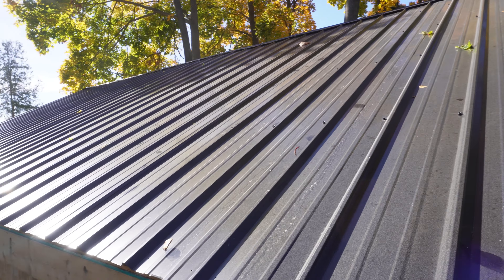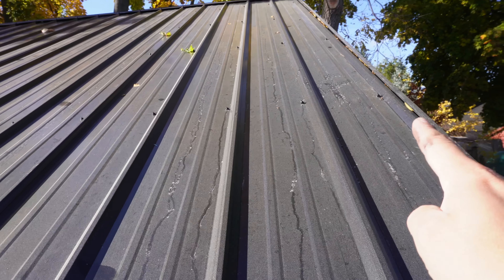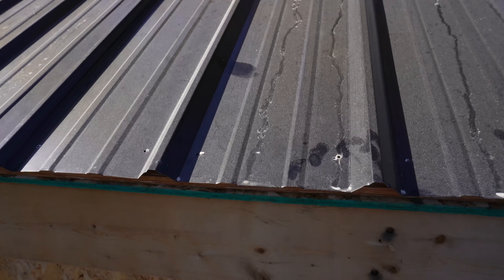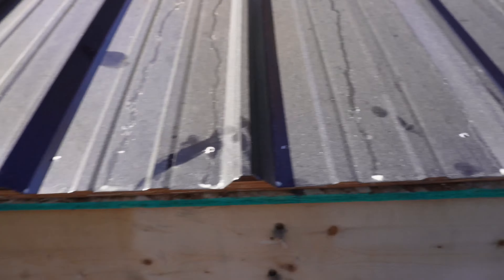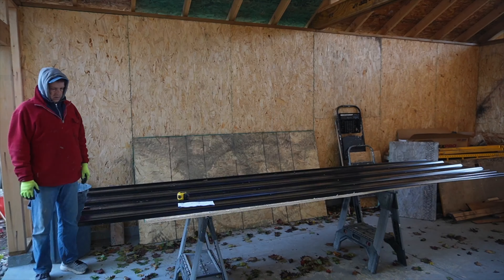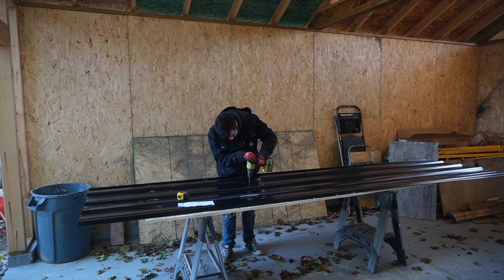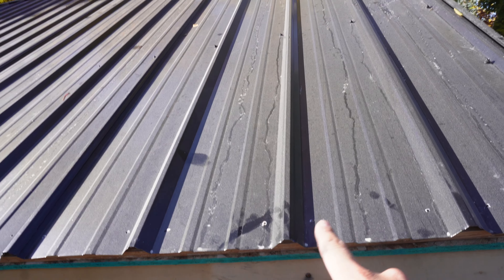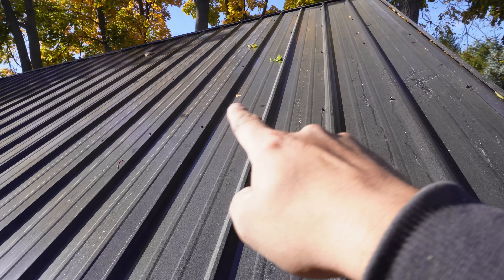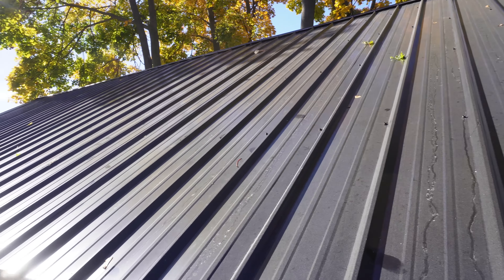One tip I've got to give for doing these steel roofs — or steel siding for that matter. As you can see my screw pattern: one there, one there, one at the top, and all my screws along the bottom. Before we brought any pieces up here, while they were still in the stack, we measured and pre-drilled all the holes at once. You figure out where you want your holes at the edge, where in the rib you want them, and wherever the pieces overlap — and you pre-drill all the holes first while they're stacked. Then when you send them up here you're not fumbling around; all the holes are there and they all line up nice.